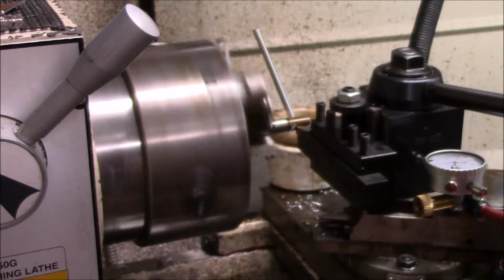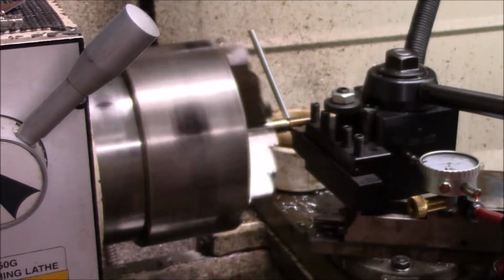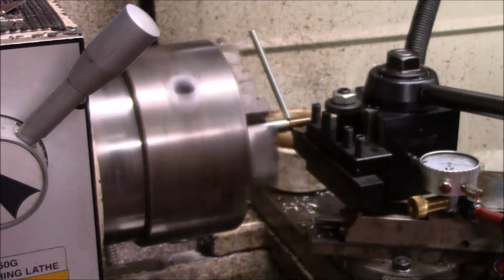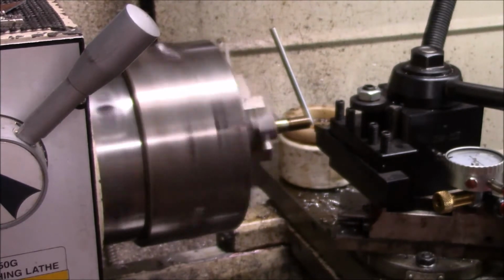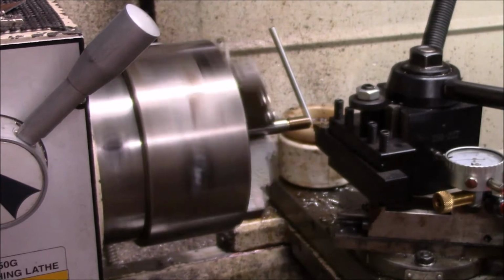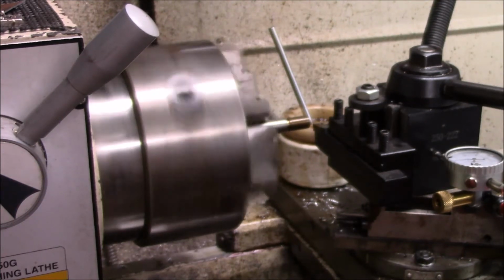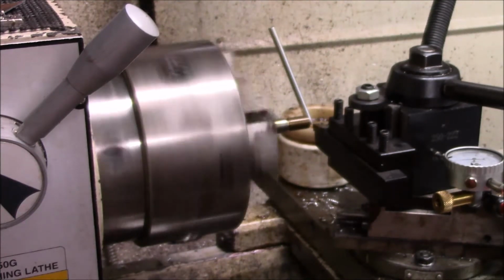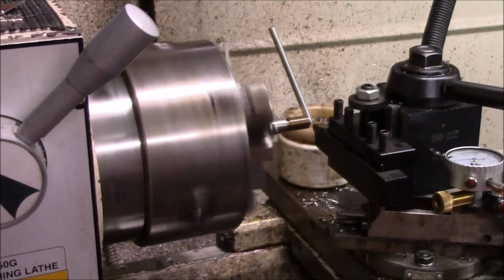And we're right around 80 thou. We're right around 50 thou probably depth. So 80, we're pretty close to the single depth that we need. The die starting, so, if it's a little sloppy, I'm going to really Loctite the handle.